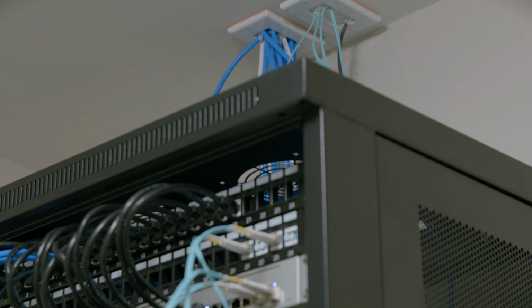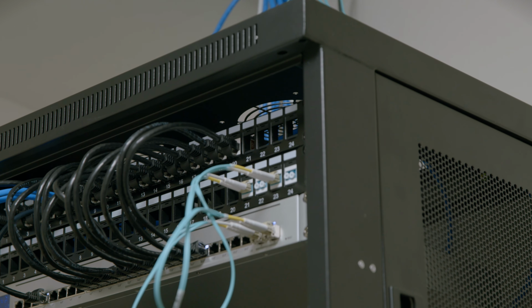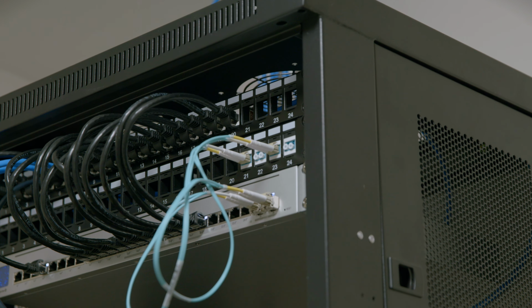What I'm going to do is wire 4 of them from my server room into my network closet, my guest bedroom into my laundry room. That way I'll have 4 uplinks from my server room, where I'm going to have my top of rack switch that's capable of 10 and 25 gigabit SFP plus connections, into my laundry room, which has all my network cables. Right now, the only switch in there that's got fiber uplinks is a 10 gigabit SFP plus connection, but I am planning on upgrading to 25 gigabit with that as well. That's for another date though.